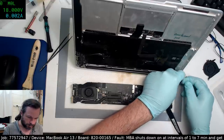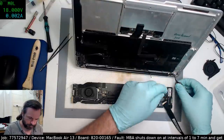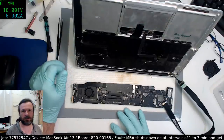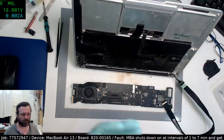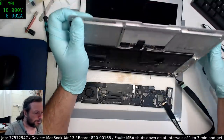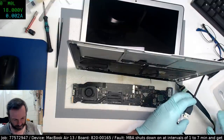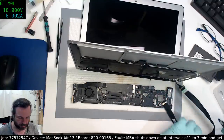SMC is certainly a possibility, yes. There could be a crack under there. It's certainly well worth exploring. I guess I would do the QFNs first, simply because it's easier to go around the QFN, solder them up, and then see if they keep behaving, as opposed to replacing the SMC outright and then going, well, that wasn't that, and then you've potentially added a new element of issues.